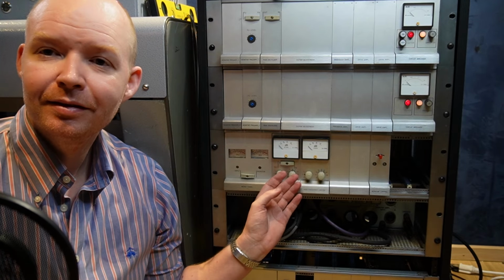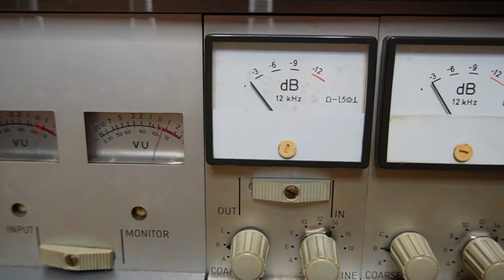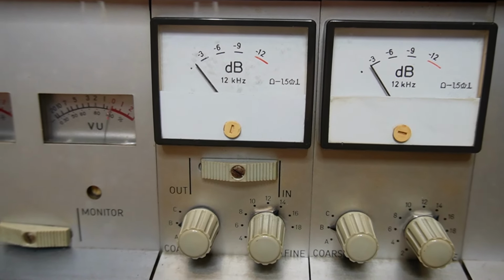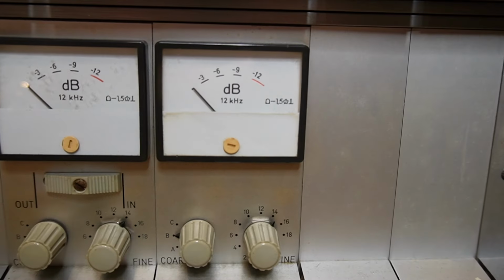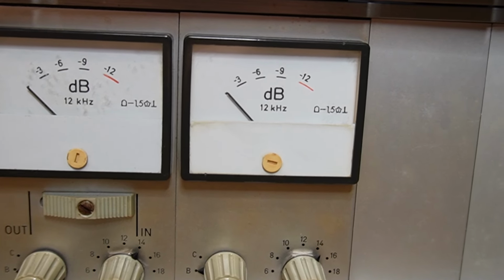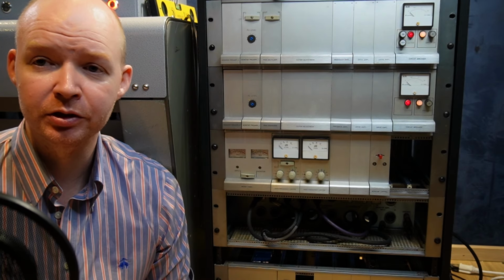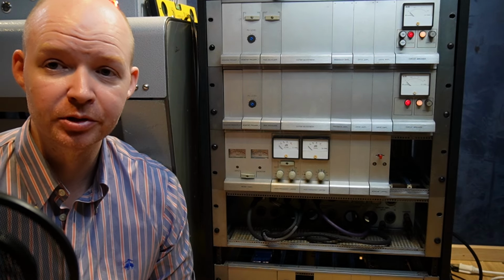The next thing that's quite important is the high frequency limiter. That's connected with protecting the head too, but it also helps remove a lot of harshness if there's a lot of high frequency content in the audio. A good cutting engineer will try to set this up so the limiters are just being tickled by loud passages, and they usually only need to be set up more aggressively with something like dance music, where you have a really loud and short cut that's meant to be played in clubs.